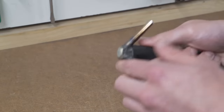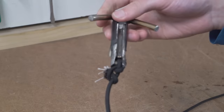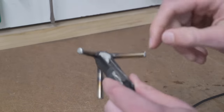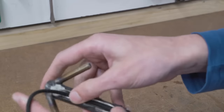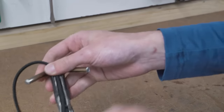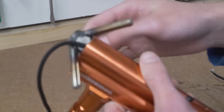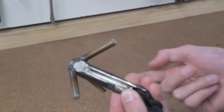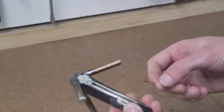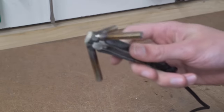Grappling hook done. I've welded the prongs on and I've welded the top closed, and here's where it's a little bit different to a regular grappling hook. This channel in here has been welded on the inside so that I can double the string over and run it back along the body of the hook. When I'm putting it in the launcher, you can actually run it all the way down the barrel and the string will come out to fasten to your reel. Then when you fire it, it goes back to the correct position. I also added a little bit of foam around here — it doesn't really enhance the safety like I was hoping, but it does give it a better seal with the barrel. When you're wearing this, it presses directly onto your arm and it's really painful because you're basically hanging your whole weight off it, so I'm going to put a piece of foam along here to make it a little softer and more comfortable.